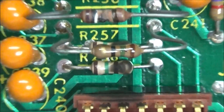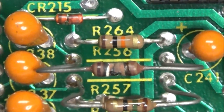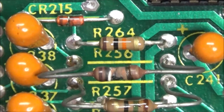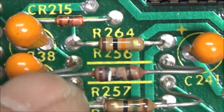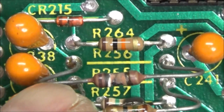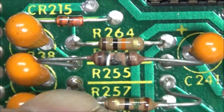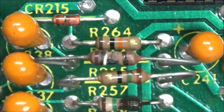As you can see, there's a burnt spot right there on this chip connector. There are two resistors here, and both of them are raised up off the board about three-quarters of an inch. That one is blown in two and that one is blown in two. That is R255. I would say these have been replaced by somebody, because every other resistor on the board is flush with the board, but these two have been raised up. The solder looks a bit different than the rest of the board. So we need to find out what R255 and R257 are.